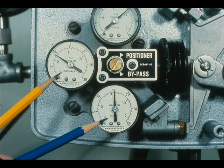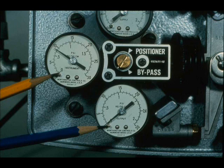Now let's consider the same situation, except this time the valve has a positioner. The input changes one-sixteenth PSI, but the valve stem doesn't move. The positioner senses the input, senses that there was no corresponding stem movement, and applies more air — full air supply if needed — to make the stem assume the correct position. The valve positioner performs whatever action necessary to position the valve stem. This could mean full air supply on the actuator, or it could mean no air at all on the actuator.